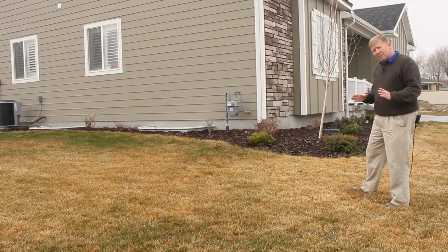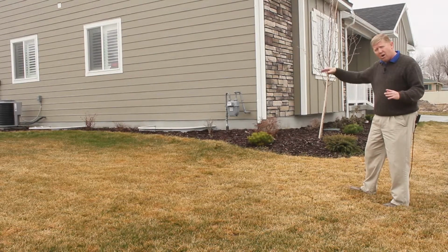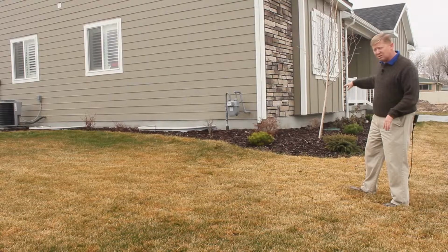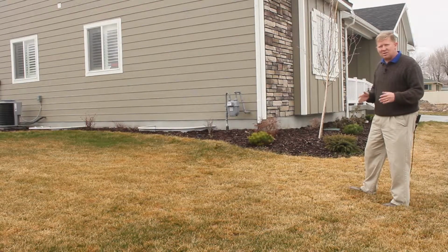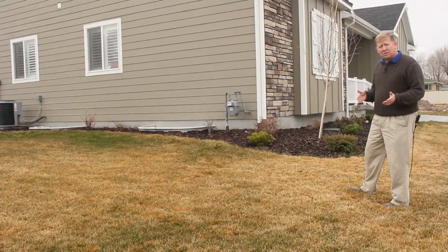What happens is when we dig the foundation, there's a hole that's dug about 4 feet bigger all the way around the house than necessary. And so the soil will naturally compact over time and you'll see some settling. So it's real important that you maintain that grade. We do our best to compact it, but Mother Nature still proves that she's better. So if you see any areas where it's settled, know that that could be a potential basement leak.